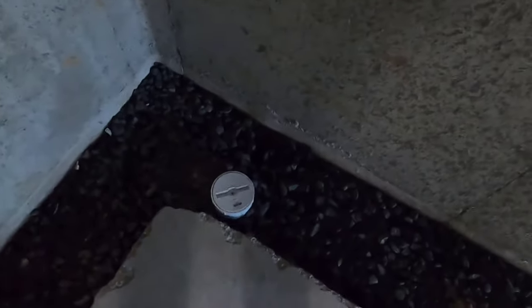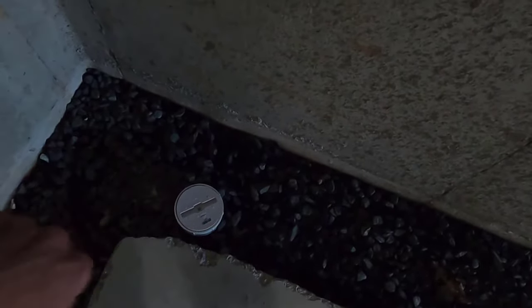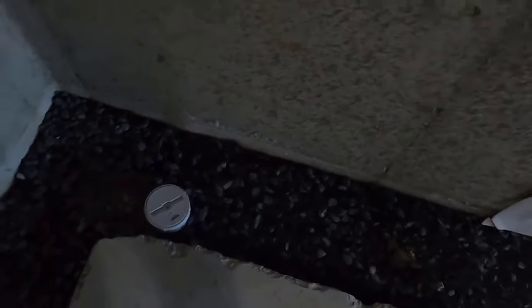All the way around the perimeter of my basement is this trench, which has a perforated pipe wrapped in a fabric, and it's pitched. This is a clean-out so that they can periodically open this up and jet water in to make sure that it runs freely. All of this stuff with this pipe is pitched all to one section of the floor.